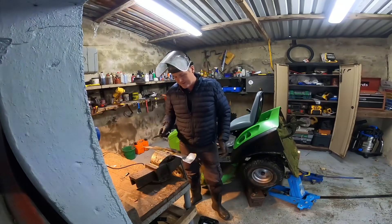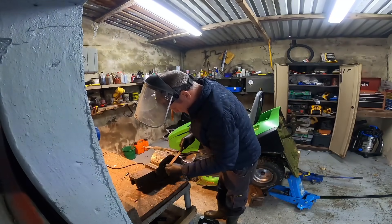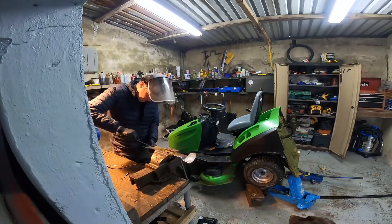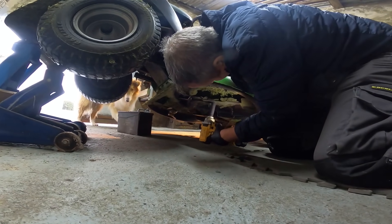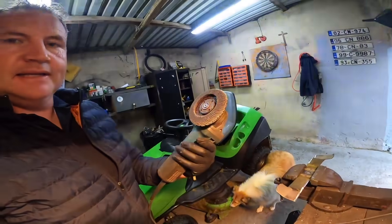When I'm sharpening any blade I always finish it off with a file. The disc I have on is just basically a sandpaper disc and it's gentle on it so it doesn't overheat the blade. You don't want to blue the blade because if you find any blue bits you're actually taking the temper out of it and it will be blunting far more easily.